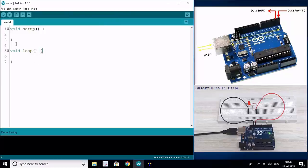You can see what I have on my screen: one is a setup function and one is a loop function. This is bare minimum code - you have to have these two functions in any Arduino sketch. To use a serial function and do the Hello World program, we have to call serial.begin(). This function sets up the serial UART peripheral on Arduino Uno, and serial.begin() takes a parameter that is the baud rate. Let's give it 9600.